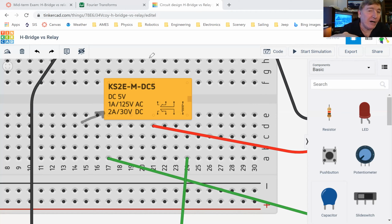And in fact, now I'm not going to go into the math here because this is more of what we talk about in my electronics class. But if you were to use a 15 volt battery, then you could push 4 amps through here. Okay, and so we're going to be using a 5 volt battery, so we could actually put 12 amps through this thing. If we have a 5 volt battery, then this thing could handle 12 amps, which is 12 times more than we actually need, because this motor right here uses like 1 amp.